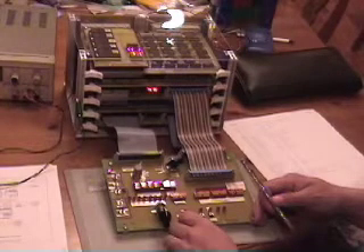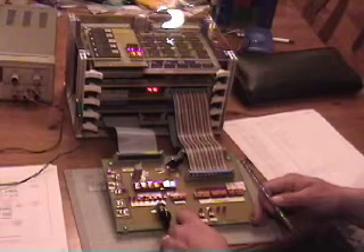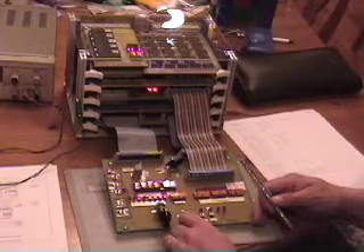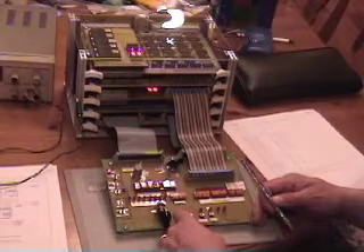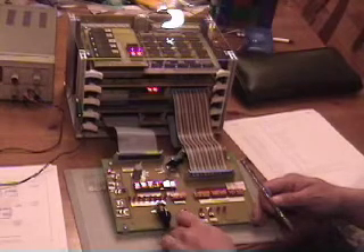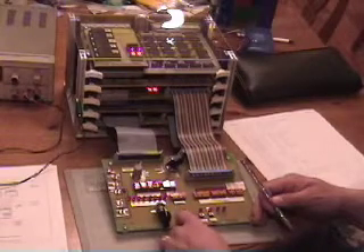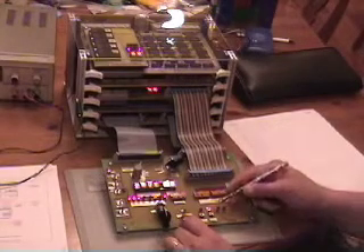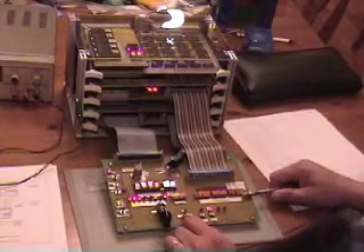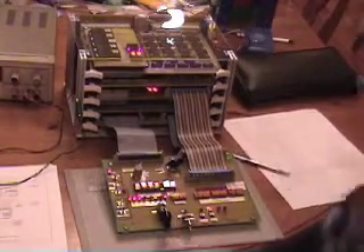Let's just go ahead and see what happens when we try to attempt a procedure call, which is a bit more complex. We're going to get the series of microcode — that doesn't look good. And we're stepping — we should be picking up the displacement to add to the branch. We go to address 7, and it failed. We've fallen through the procedure call when we should have branched. So now we've reached the halt state. Okay, so it didn't work. We'll do some debugging and try again.